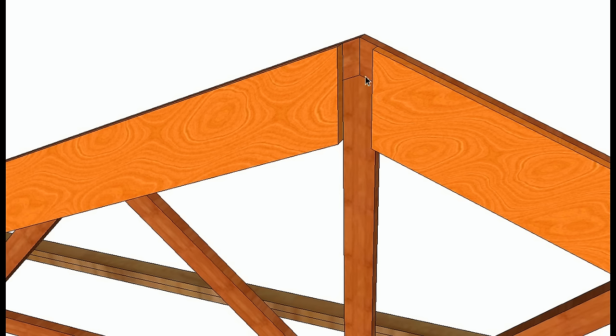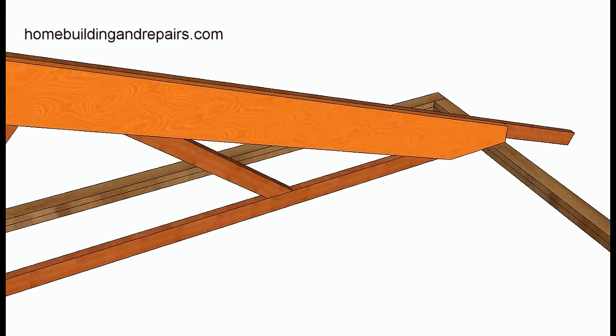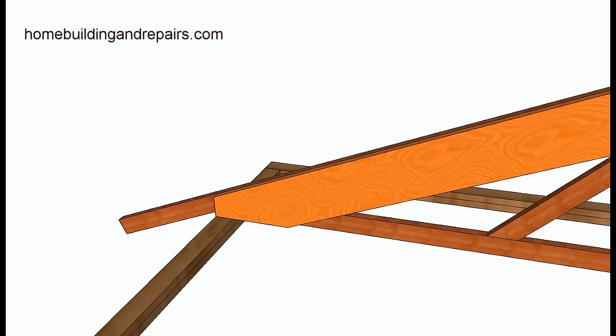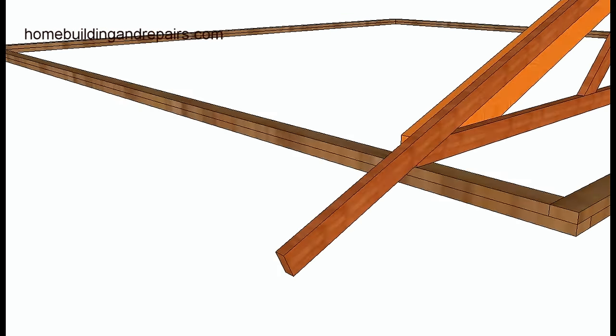First thing I'd like to point out: you need to leave the trusses where they're at. You cannot cut the trusses without supporting the rafters. You're going to need to install the rafters and leave a gap for the beam to go into if this is how you're going to be framing it. You will not be cutting the trusses until the building is supported with the conventional framing.